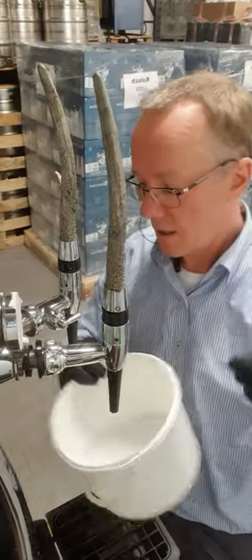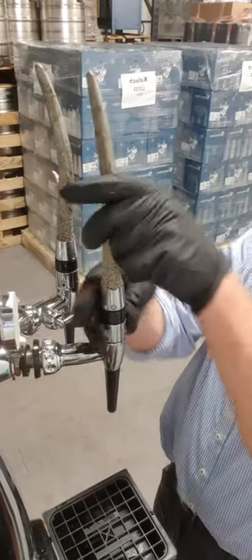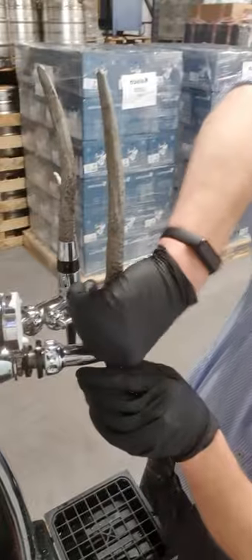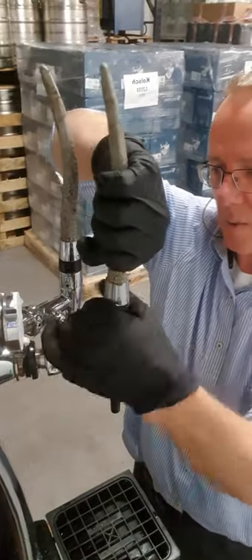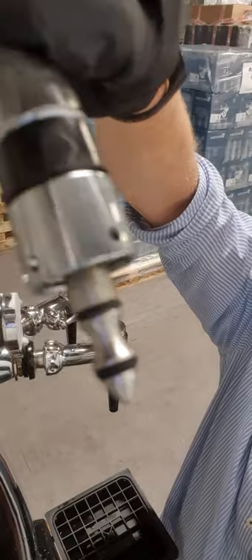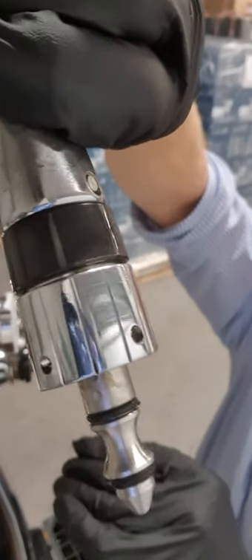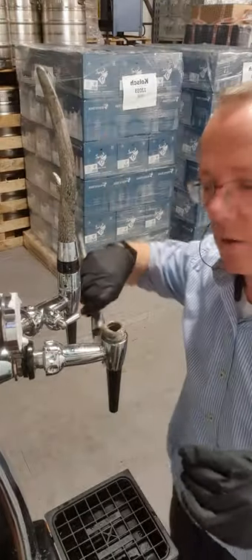Just make sure there's no pressure in the tap. Unscrew this and you'll see two O-rings in there. If you have a dripping tap, this O-ring is nicked or there's something leaking on it. They're so cheap — get onto whoever supplied you the equipment, or if it's generic, get onto maybe MLH Holdings or BTI Engineering.